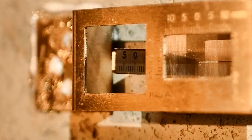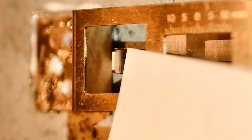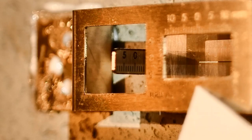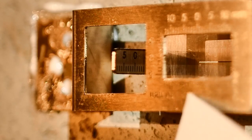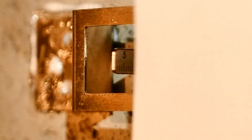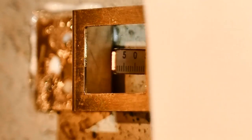This tab sticking out toward me has markings on it and is part of the bottom piece. When the wall moves in or out — toward or away from you — this piece moves with it. The top surface of the top piece is your reference point for taking the reading. You use something like a card — this is my business card — and slide it over the tab until it hits a number. That number is your initial measurement for depth movement, and most of the time it won't be zero because the wall may have already moved before you installed the gauges.